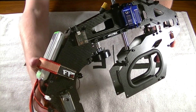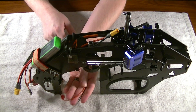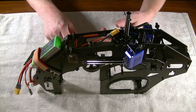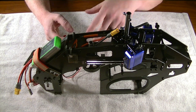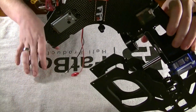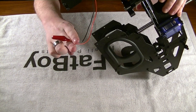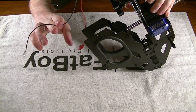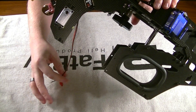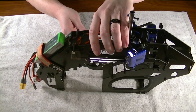Being Freddy Can Fly, I always try to find the absolute cleanest and most beautiful method possible. We do have two wires left — positive and negative for our glow igniter. We can't do much with these right now because we have to wait until the motor is installed. I have them just hanging out the back. This will go to the glow plug, and this one will ground down to the motor. We'll get to these once we install the motor, fan shroud, and everything.